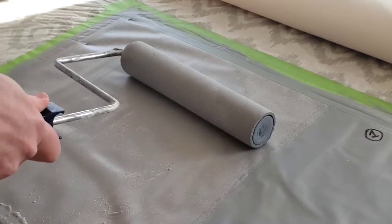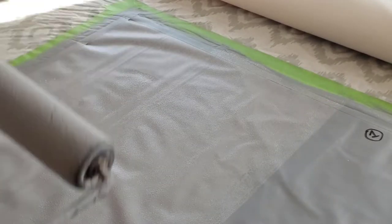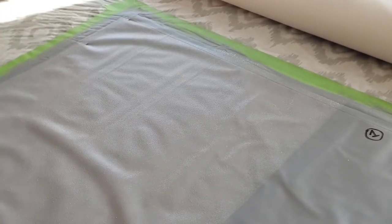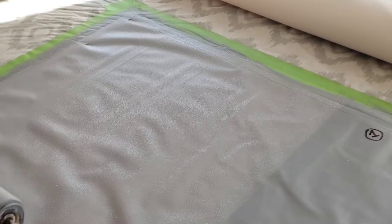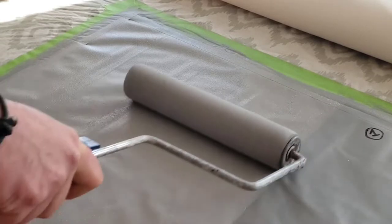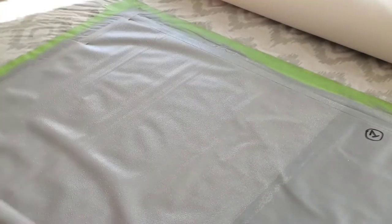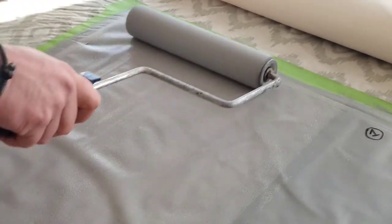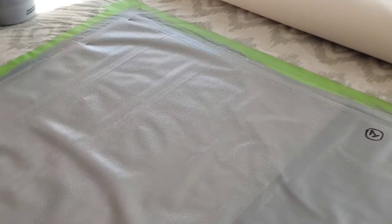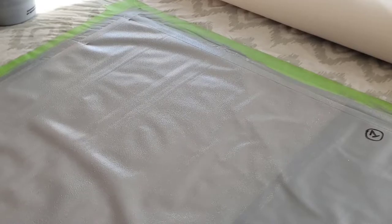See, paints, if you use paints, especially as a primer, paint has a lot of particle and a lot of tint powder in it. So if you've got, let's say, a light texture on a surface and you're looking to smooth that texture out, a couple of coats of good primer paint can do that. This material, the Partay formulas, will never do that. They're not designed to do that. They're designed to leave very skin-like thin layers on the surface. So if you're going to paint a surface, you want to make sure that you're painting a surface that has very low texture. You can have some texture, that's fine, but it needs to be a very fine texture.